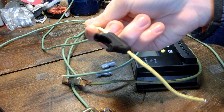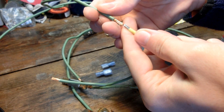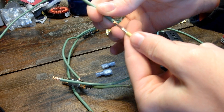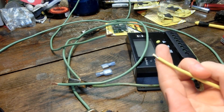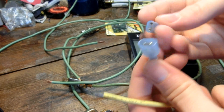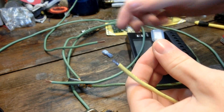When I went out to get these fuse holders and fuses, I forgot to get little crimp connectors to connect the wires together. I entertained the idea of soldering it, but soldering might introduce a weak spot where it could melt if too many amps are pulled through — that would act as a fuse, but I wouldn't know at what amp level it would break. So I'm using these connectors left over from my electric bicycle project.